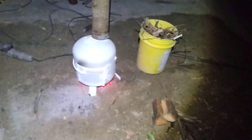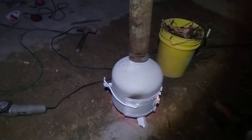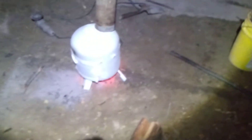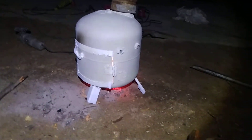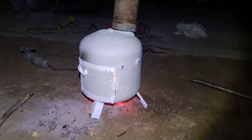The flames came out and blackened it, but I'll be throwing another coat of paint on there. Right now at least this will bake the paint on pretty good. This paint resists up to 1200 degrees. The wood burning stove will reach roughly 800 degrees, so it does get hot but not enough to burn that paint off — at least I don't think so. We're going to find out for sure.